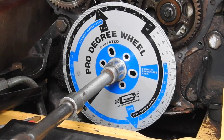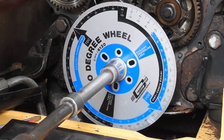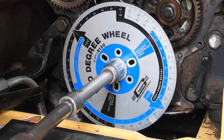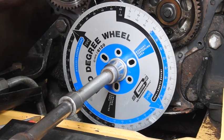We're going to go ahead and rotate this beyond that 28 degree point. See all the gears turning—there's exactly 35 degrees. Remember now, we've got the gear loose here because we have the shaft on the injector pump locked in position for the beginning of the injection cycle on cylinder number one.